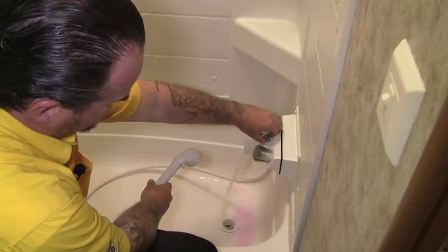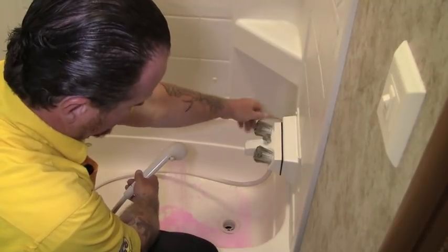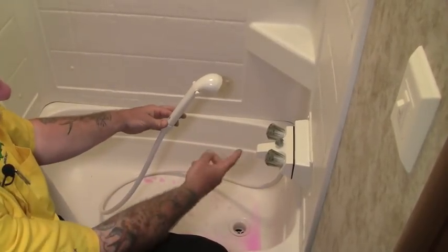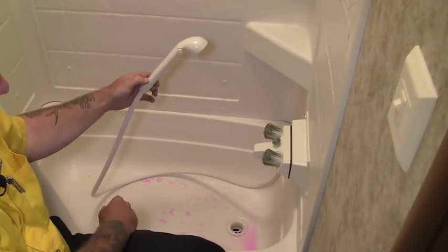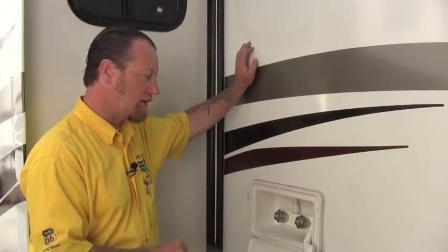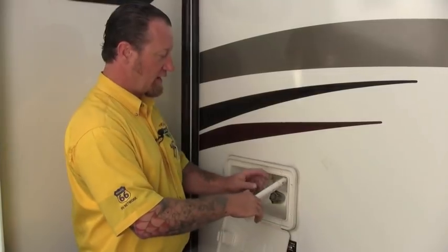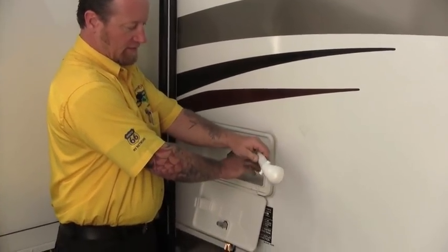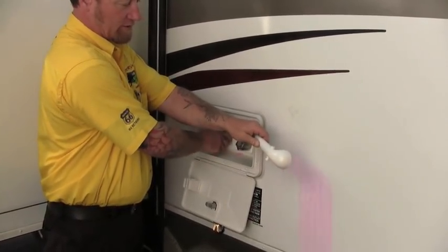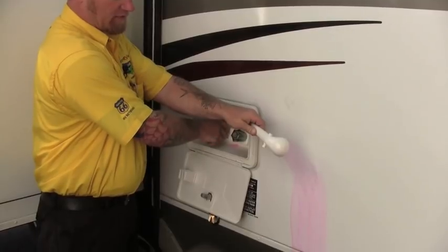Cold, then hot, now I'm going to run it up through the shower head. I've got good pink everywhere — we're good to go. Some people undo the shower head from the faucet to alleviate any water or antifreeze that may sit in there through the winter. A lot of coaches nowadays come equipped with an outside shower or hot and cold running water outside, so make sure we get that. I can honestly say I've forgotten it in the past, so put it on your list. Turn the water on until you see pink — a good way to see it out here is running it against the body of a white coach. Make sure you've got the water out and there's a good pink flow.